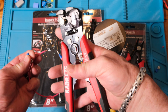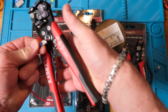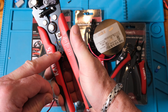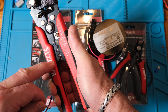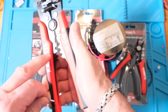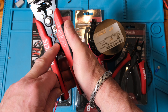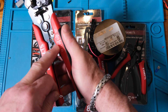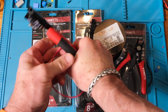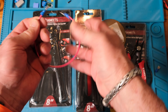Let's try the crimper on this third tool. It shows red, blue, and yellow connector sizes — yellow is the bigger one. This section here is for non-insulated connectors, and this section is for insulated, so I'll use the insulated jaw. Squish all the way down — there we go. Very tight crimp. These are kind of nice when you're doing a lot of crimping — just put it in and go.